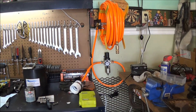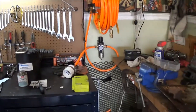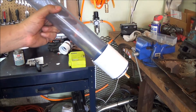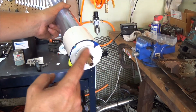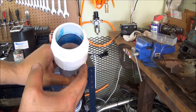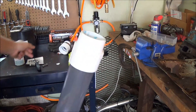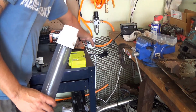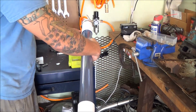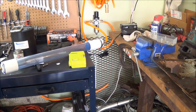This is what we have going on now. I've got the line coming from the water separator — it goes behind the little workbench here, and you can see the line at the bottom right here. That line is going to go into the bottom of the desiccant tube. We've got our reducers and the coupler to do the hose clamp right there. This tube is going to be filled with the silica gel color-changing, and then I've got on the top a slip to male threaded two inch, which is going to go into this. I'm going to mount this down here and then this will screw into it. The air will now go through the bottom, through the desiccant, then go to my regulator.